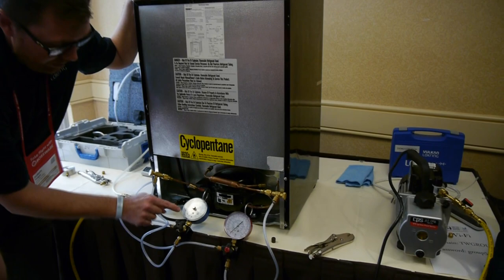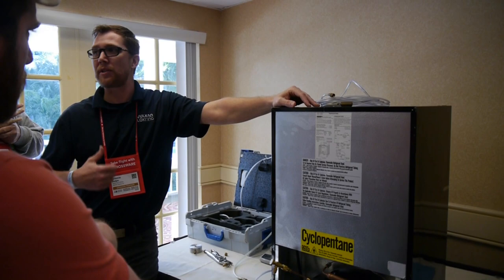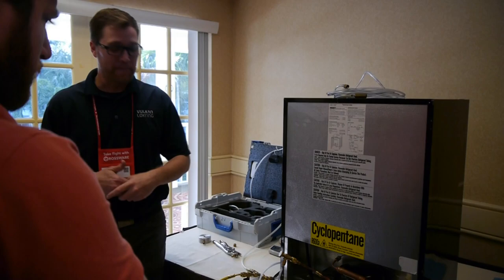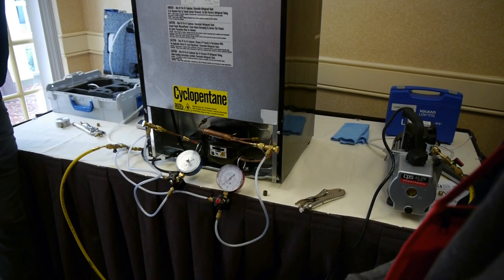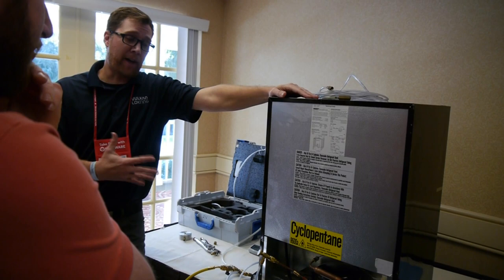For classroom expectations, our goal is already reached — it's pulled back down to that ultimate vacuum level I saw before. Generally I'd wait 10 to 15 minutes. I'll go clean the condenser, check door gasket seals, look at anything inside, start filling out paperwork, clean up — use your time wisely while it does its thing. Then I can come back, isolate my vacuum again after time has passed, give it another five minutes, and make sure I don't see a micron rise. If I don't see any rise, I know I'm safe to charge. If I do see a rise, there's still refrigerant in there and I could potentially overcharge the system.